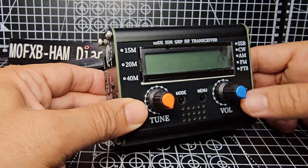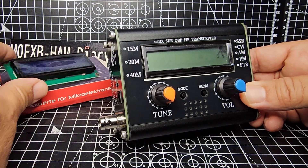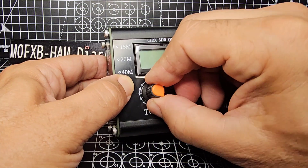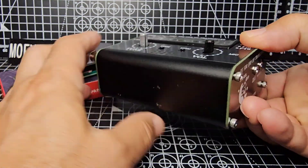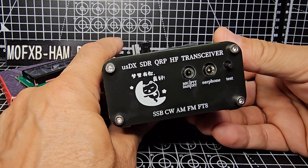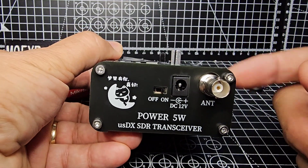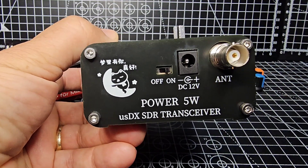The buttons just pull off and we're going to take this apart and fit this new screen. Pull off the buttons like so, and then you've got the allen keys either side so we'll just take them off now. It does dismantle very easily and I'll show you where you can program firmware on this.